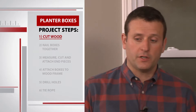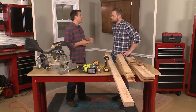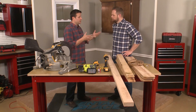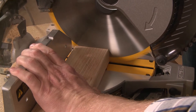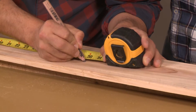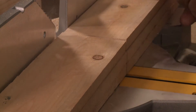The first step is to determine the size of the boxes we want and cut the wood. We're going to make a series of three planter boxes that are going to be attached to this 2x4. We need to build three 30-inch planters — this size is based on the material that we had. Sean starts by measuring and cutting 2x4s into two 40-inch sections. Those will make up the frame that we'll attach the boxes to. Next, he takes the scrap pieces of lumber, measures out 30-inch sections, and cuts enough to make six long sides for the three boxes.